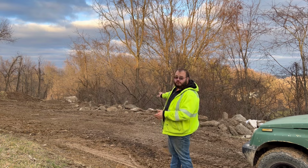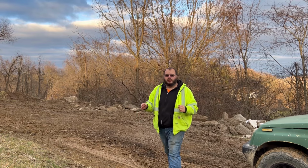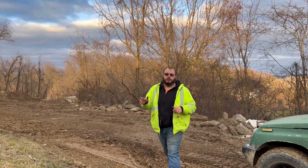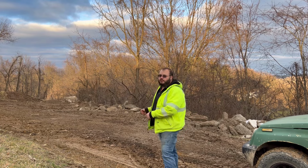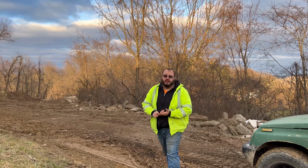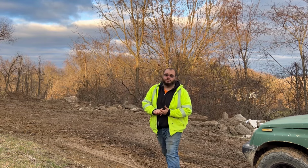Hey everybody, I'd like to add to the end of this video that I just used the dozer to shove this stuff over the hill, and these new brakes are like a night and day difference over when the Chinese brakes were new. These relined brakes are no joke. I'm talking just touching the stick and it grabs and cuts like it's supposed to. Do not waste your money on those aftermarket pads. Wait the 2 weeks, 3 weeks, whatever it takes, and spend the extra money to have your old shoes relined. I promise you will not regret it.